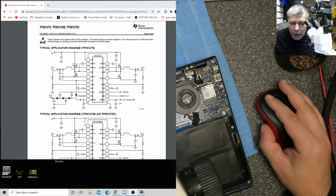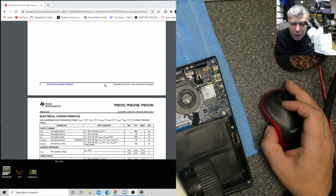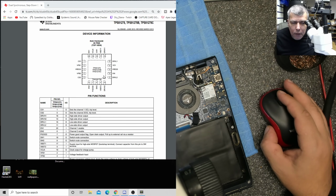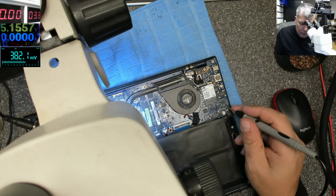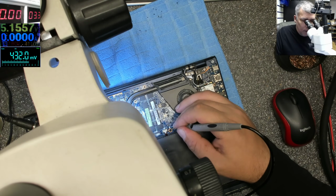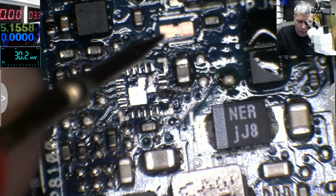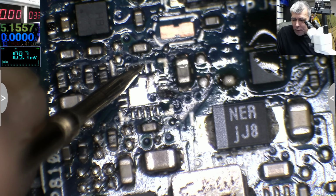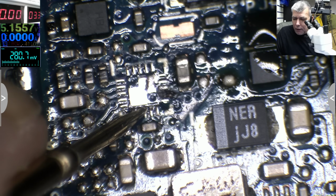And you have two more power supplies driven by these MOSFETs. So what do I want to check? I want to check this SW2, no, SW1 for short. SW2, SW1, let's check. So that's the one, and it is shorted. Here it's a short. You can't see, sorry. So this one is shorted here. You can see the multimeter, but trust me, it's shorted. SW1, and this one is shorted again. Both are shorted, 3.3 and 5 volts. Our laptop is completely dead.